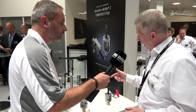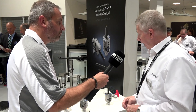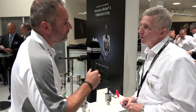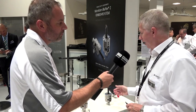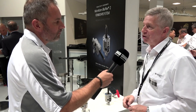Higher speeds are possible because of the dynamic balancing of the tool — a good all-round precision boring bar from Comet. And it leads into your new Comet cloud as well — the tool scope will show you the performance of the bar and show your tool data, which I know you're going to talk to one of my colleagues about very shortly.